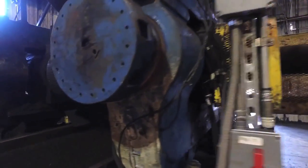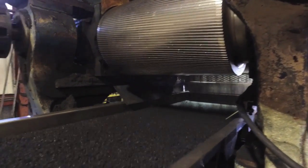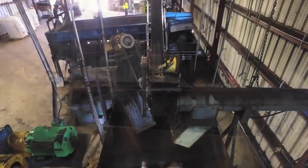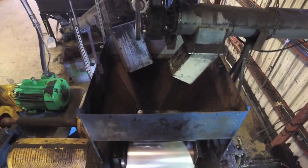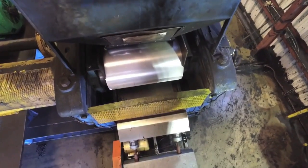Utilizing a CM dual-drive cracker mill, the granulated rubber is cracked or milled between two serrated hardened rolls positioned very close together to achieve the cracking of the rubber. Heat is generated during this process, so a chiller is utilized to dissipate heat and keep the machine cool.